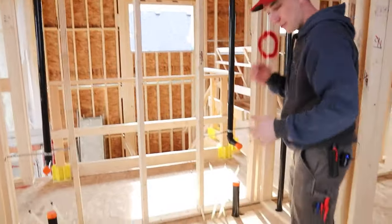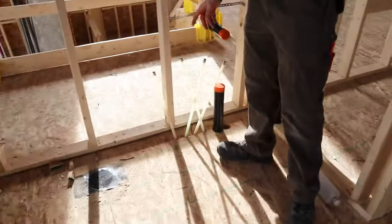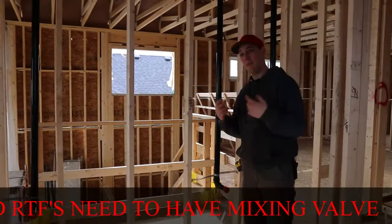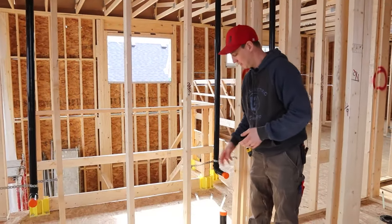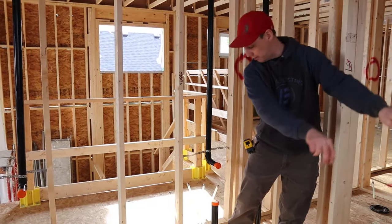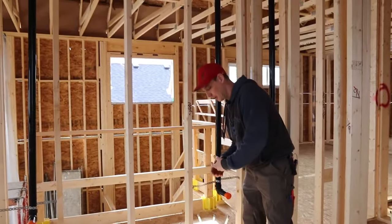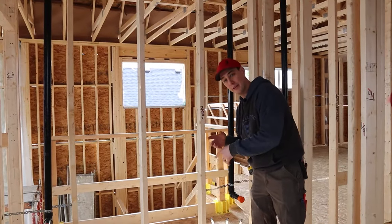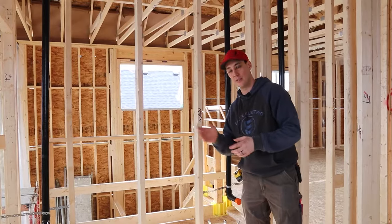We've got two sinks, and you're probably wondering why there's four water lines coming up on this one. When you have a two-handled faucet on a bathtub, we have to have a mixing valve — you can't just run straight hot water and scald yourself. So the hot and the cold from the soaker tub, from the RTF (the Roman tub filler), they run over here and pop up into this vanity. At finish stage you do a mixing valve to mix hot and cold together so you don't have super hot water going there. You can adjust the temperature for that.